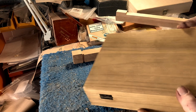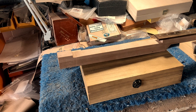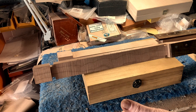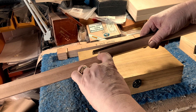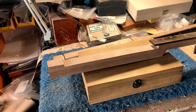The whole point of this is really just to say there's no right or wrong way of doing this — you can do whatever you want, there's more than one way of skinning a cat. We're going to stick to this method, but I'm glad I tried the alternative. This doesn't add any strength to the joint because the whole thing relies on the through-neck, and what you've done with this method is weaken it a fair bit. Introducing all these little angles is where you get cracks starting if you drop it — any sharp angles like that are the commonest place to get a crack. The more sharp angles you cut into something like that, the worse it is. That's my two penneth — thanks for watching.